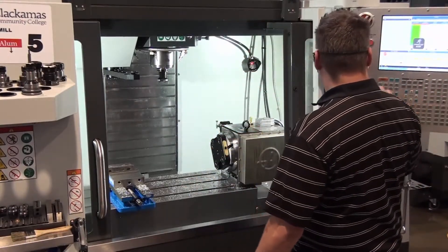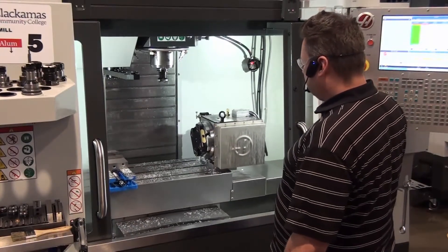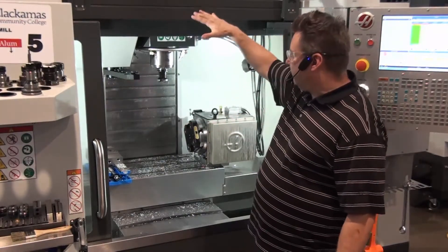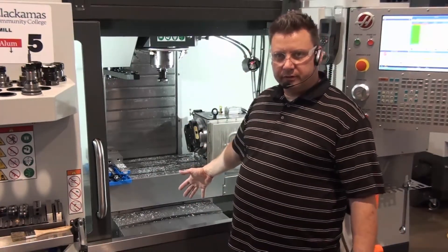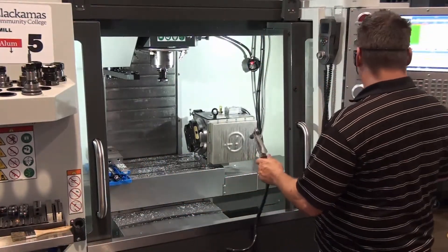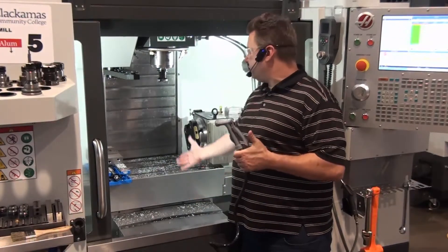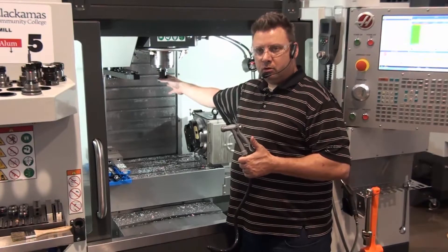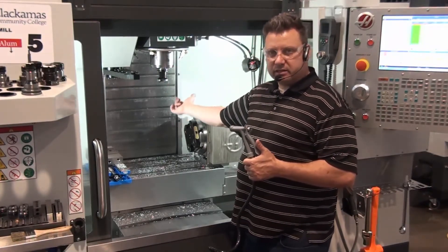What I like to do is jog the table all the way back, because the first thing I'm going to do is clean the top of the table — cleaning from top down. If you have the table up here, you're just going to spray yourself with coolant. I'm going to use the coolant gun, and I'm going to make sure that there's a tool in the spindle. Do not use coolant inside the machine if there's no tool in the spindle — make sure there's a tool or tool holder inside the spindle to keep coolant and chips from going up inside the spindle.